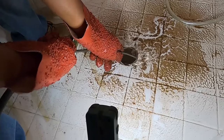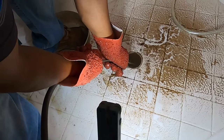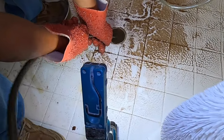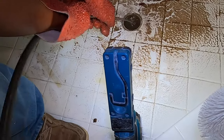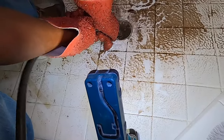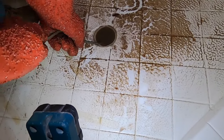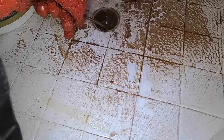You don't want to go too fast — you want to clean these pipes real well. It's going real slowly. We've got a little bit of water in there; it backed up and it's not going down, but we do that on purpose. The reason we keep a little water in the drain line is so we'll know exactly when we've hit our cloggage. He's just going round and round, bouncing around in that water a little bit.